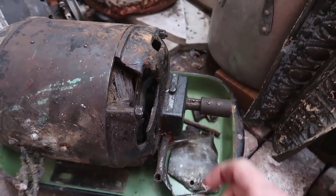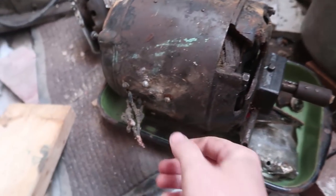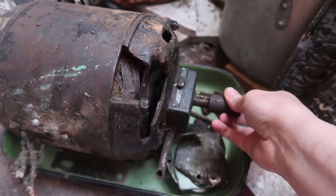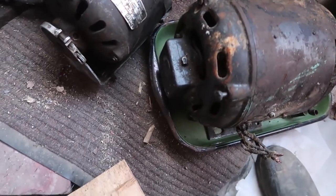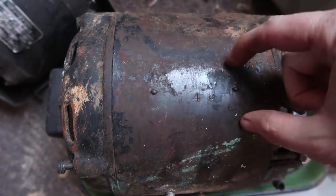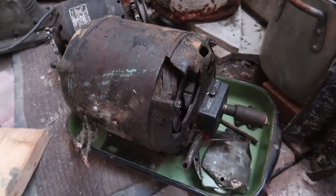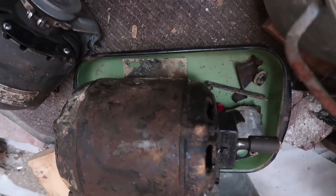That'd be nice. And then we also want to look at the bearings to make sure that the bushings are good and they're getting plenty of oil. Fix the wiring. Add some shims, because one of the shims broke off. That'd be good to fix. Maybe try to identify what type of motor this is. I believe it's a repulsion start motor, but it just really sucks that the label is gone. So maybe I should make my own label, or some other name. But if I could find out what motor this actually is, like a Baldor or Chicago Design or whatever company, it's probably missing now.